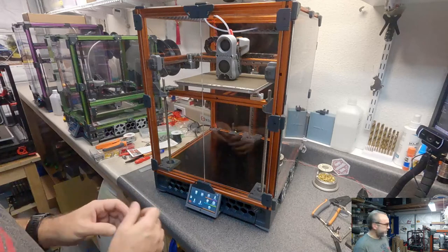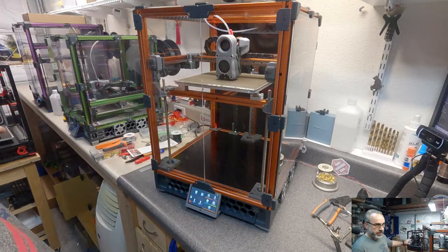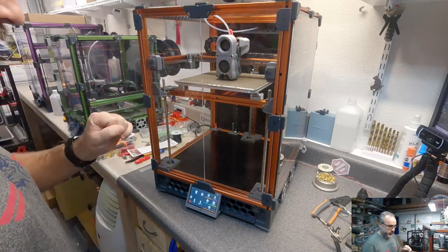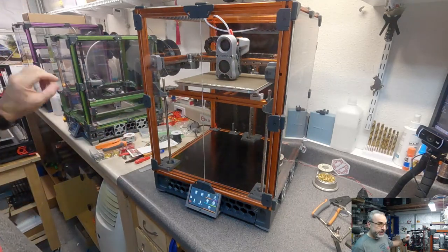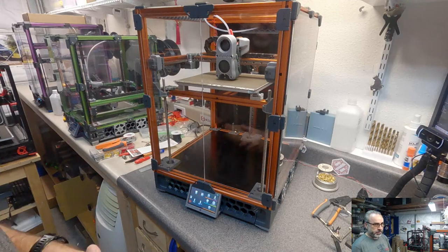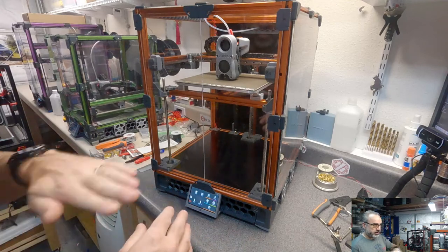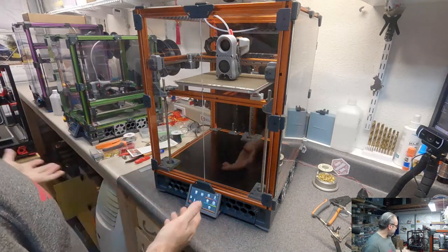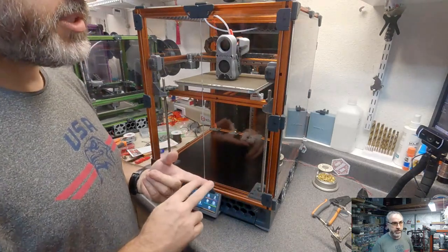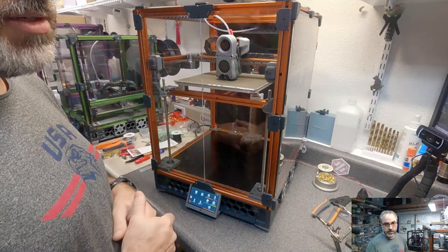Yeah, that's also the plate that I have that's tacoed. It's just a MIC 6 plate I bought from the Midwest place with a one-time use credit card. It's thick, and I have a friend with a machine shop that we did the cutting of the holes and stuff. At some point, I may bite the bullet and just have it machined flat again and see if that helps, but that would require replacing the magnet, which is frankly about ready. It's starting to get a little crusty, but more importantly is replacing the silicone heater on the underside.